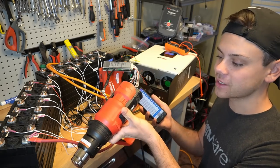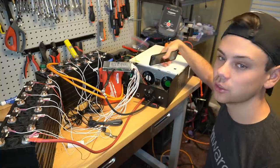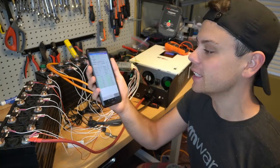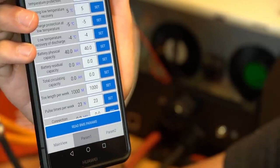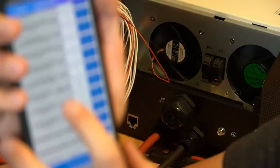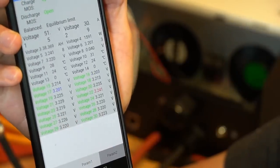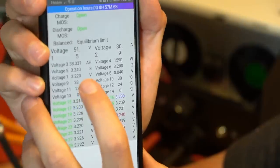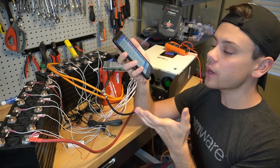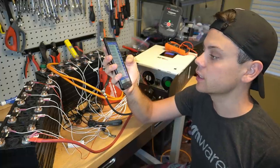I was confused because the inverter wasn't showing up on the app, but it was in bypass mode so I needed to disconnect the utility and power from the battery. Now it says 1500 watts and the amp hours are decreasing — the coulomb meter actually works! To set the capacity monitor, go to battery physical capacity setting and set it to your cell size. These are 40 amp hour cells so I set it to 40. After one full charge cycle it calibrates automatically and tracks state of charge from there.